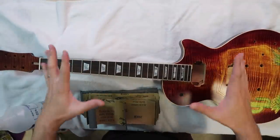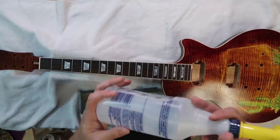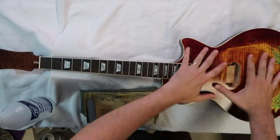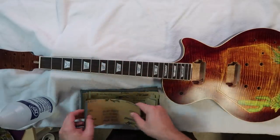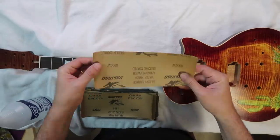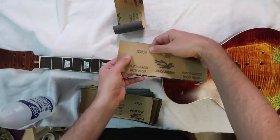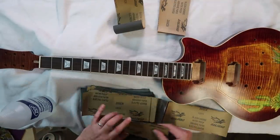I have laid out a towel here — it's gonna get a little wet and messy. I'll be using some water, just water with a tiny bit of dish soap, so that any bits of lacquer that come off won't scratch the face of the guitar — they'll slide over it because of the water and soap. I have a big stack of silicon carbide wet-dry sandpaper, with a whole bunch of different grits. I'm going to organize them from 800 grit up to 2000.